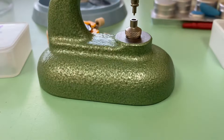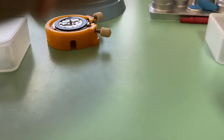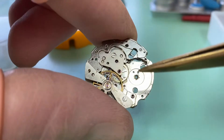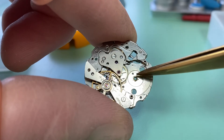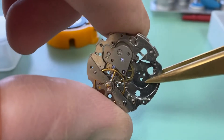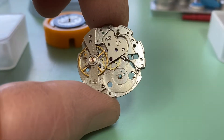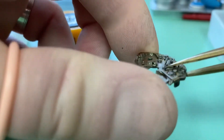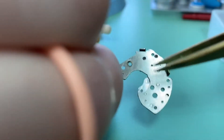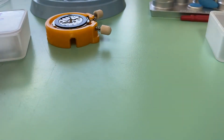We also use the Horotec tool to press in the one in the main plate afterwards as well. Here's a good example of a mostly stripped-down 6139 movement. Do you see this rubbing and this wear here, all this dirt? They really wear — the dirt and filth comes out of the barrel as well, and mixes, and that is what happens. They just wear inside. We can see how filthy that is. They wear, and the hole actually ends up oval in a lot of cases. It plays havoc with the timekeeping and the amplitude. We can see in the top plate it's kind of the same scenario — absolute filth. So we push that out with our Horotec tool, and then we can actually see the wear. We push that out and pop a jewel in, then drill the one out in the main plate and pop a jewel in there.